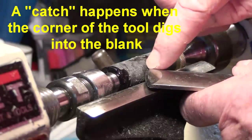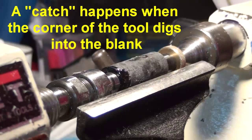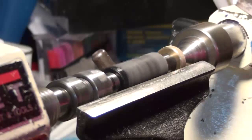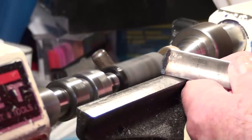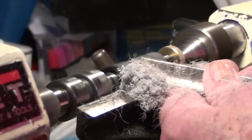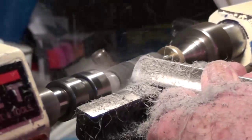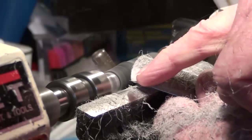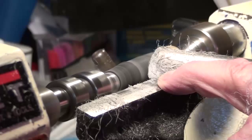You really have to be a long ways off from here to here. This is where you should be cutting; this is where you end up cutting when you really screw it up. So let's go back to an in-between tool — three quarter inch, which is what I like to turn with most of the time. We'll turn the lathe on and turn the speed up, because it's easier to do it fast than it is to do it slow. Now what you'll see here is that I am turning with the lower portion of that skew and my tool rest is approximately equal to the center of my turning object.